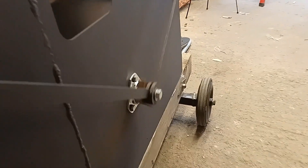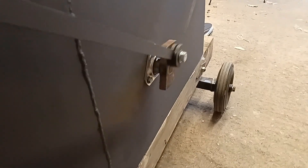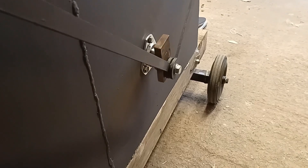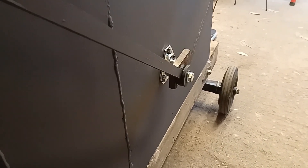There's a slight scrape at the moment on the crank. It's because the washers I'm using for spacers between the bearings are actually touching the outside base of the bearings. So I'll need to grind the edge of the washers off a little bit to stop that, but other than that I'm fairly happy.